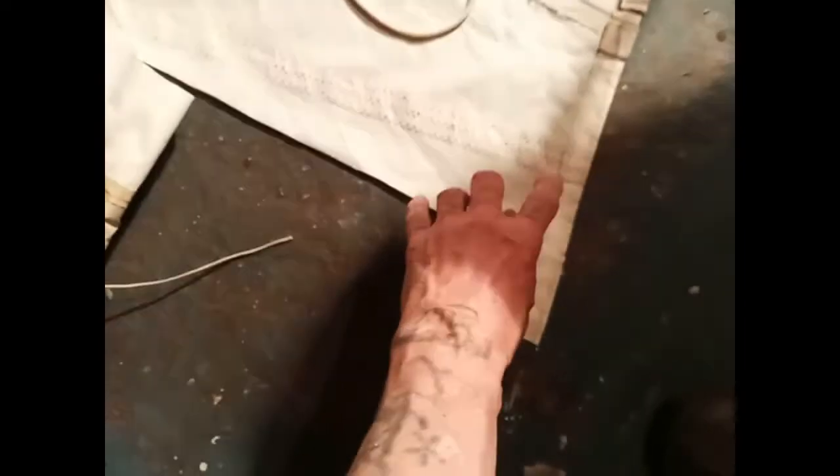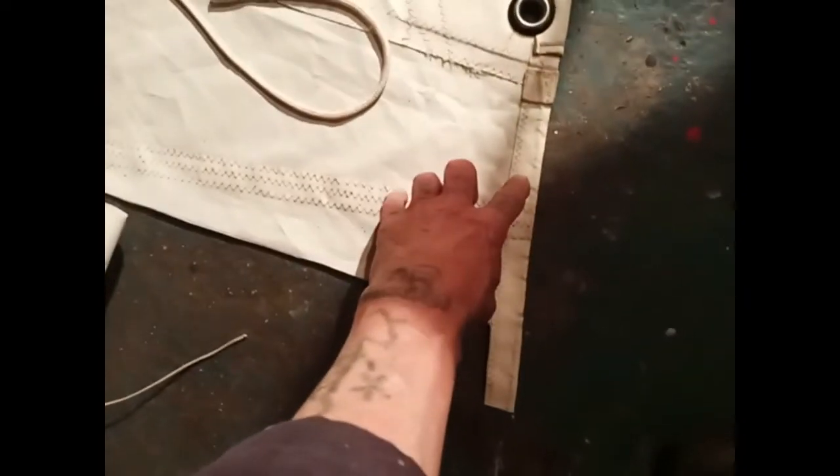That overlap will give me the strength back, and this whole piece is gone because that's the rotten bit. Now my sail will be — if I had reefed it, it would have reached down to there — but by the time I've sewn this back on overlapped, it's going to be about down to here. So it's more or less the size of a reefing sail. I'll have the main small sail and hopefully it'll help me with the bad weather helm I get.